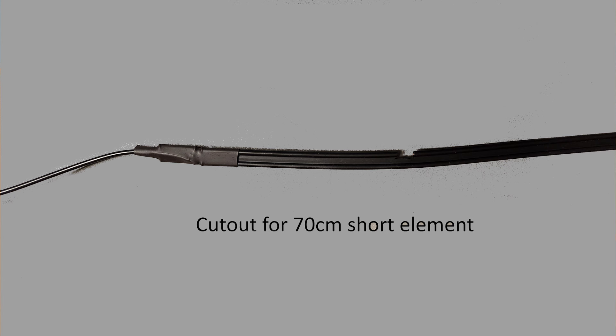This all has to do with the fact that the antenna has very high impedance at the open end and no impedance at all on the shorted end. The good news is that the antenna comes fully and properly tuned. As you can see in this picture, the UHF or GMRS version of the antenna has the matching connections at the bottom and a cut in the ladder line where the one-quarter wave point is for the short element.